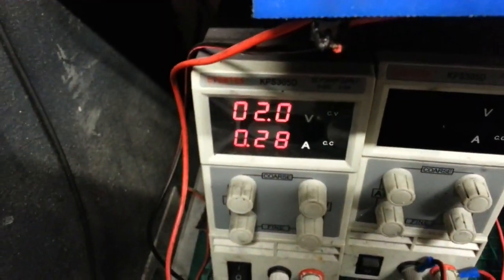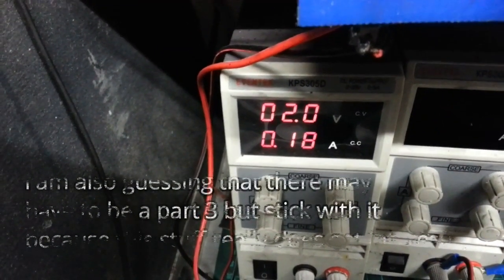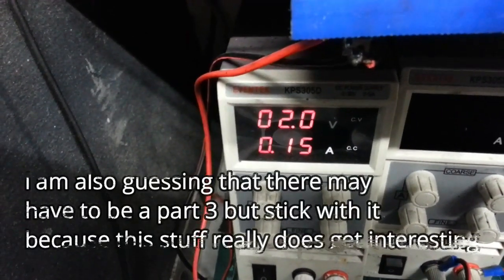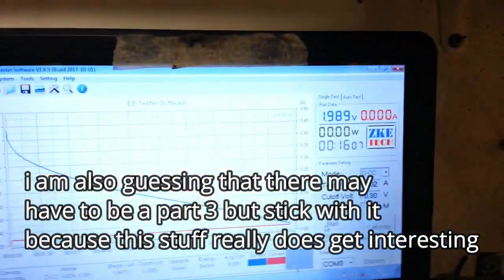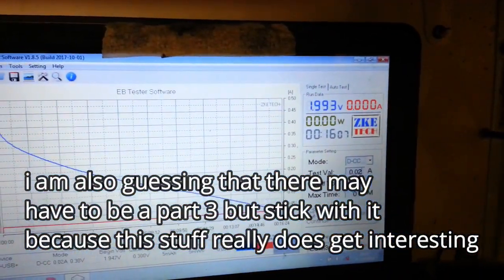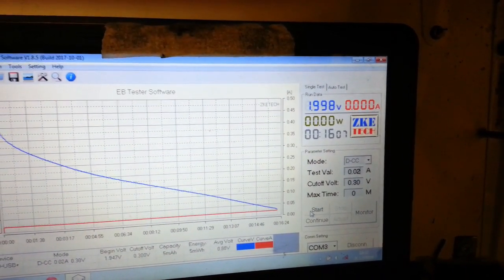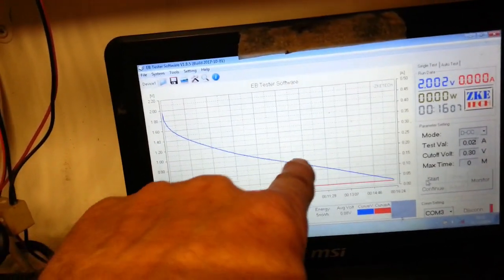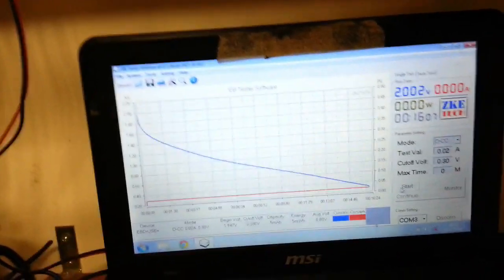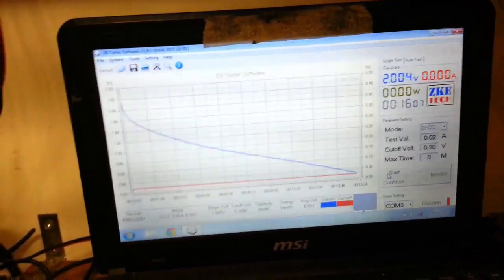It's drawing quite a bit of current, as you can see. That's 200 and something milliamps, 100, 70, 60. So it's doing it all right. Voltage going up. So yeah, that curve started to develop into a battery curve, but I think let's form the battery up a little bit and give it 2 or 3, 4 charges and see how we get on. So I'll come back.